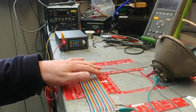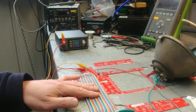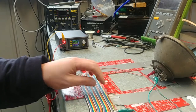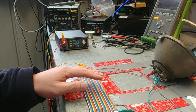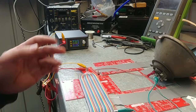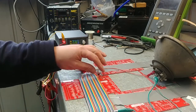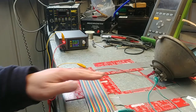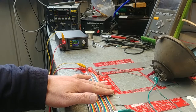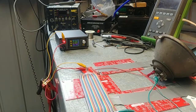Based on my testing, these lines will typically become quite soft around the 5 amp mark. My recommendation, based on quite a bit of testing with these, is to limit yourself to somewhere between 3.5 and 4 amps over a single strand of this DuPont cable. Of course that means per injector channel you're looking at somewhere around 7 to 7.5 amps — so that's just a quick video showing how you can use these DuPont cables to carry fuel injector current safely, even with pairs of injectors.